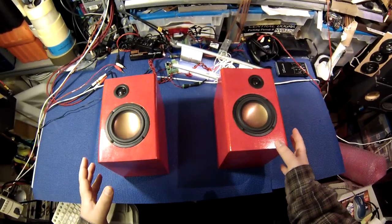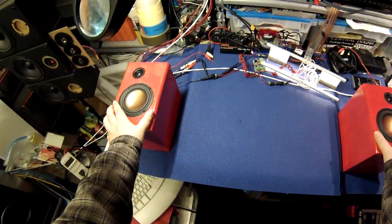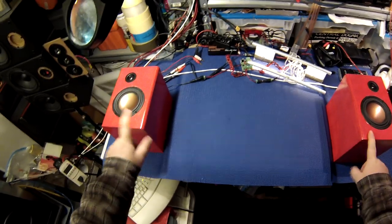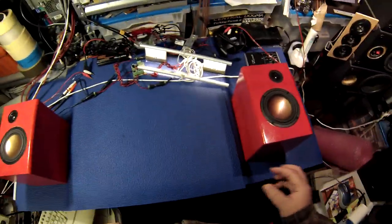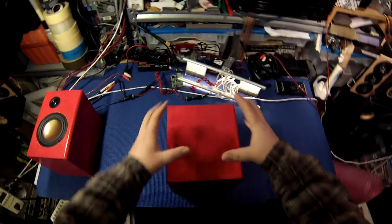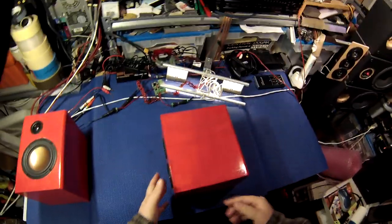This is a legitimate practice — you can do this. I believe in you. I believe my audience can handle these speakers. If you're a super do-it-yourselfer with a woodworking shop, you can literally just download the plans, buy the drivers and components on your own, and build your own boxes to whatever shape — it's about the volume, how many cubic centimeters of air is inside. Make the box that shape, make sure the port depth works, and you're good. These are excellent, excellent speakers. You just have to build them right and finish them, and then you're set.